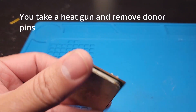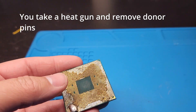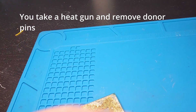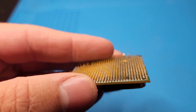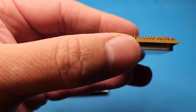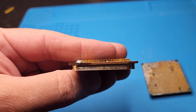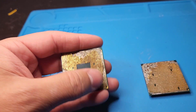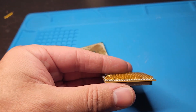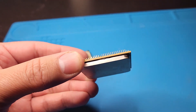The first thing you need is a donor. I've got this — I don't know what the heck it is — a 2200G. That is my donor. I've also got an old FX chip that I use both of these for donors. The reason I like to use both is because the pins are different. This is taller — the old Athlon series. They're taller than the Ryzen series. And the cool thing is if you have damaged pins in the middle or a part that's really difficult to get to, you use these taller ones and you drop them in easier. So it's pretty convenient to have them.